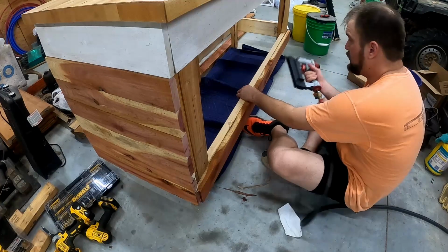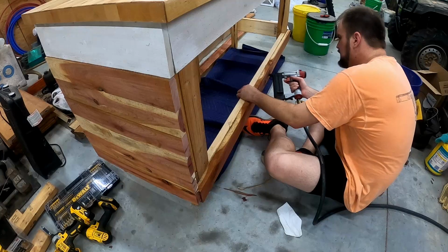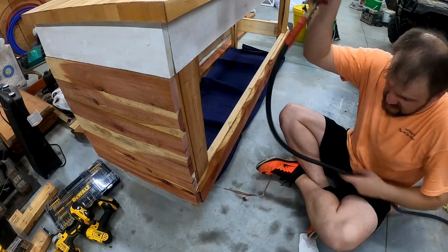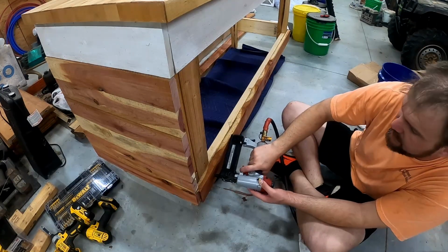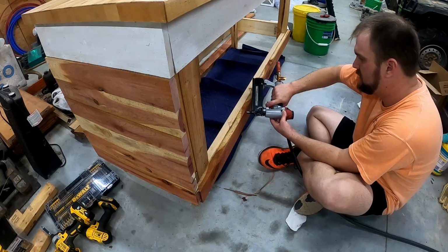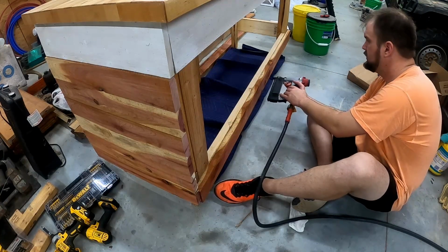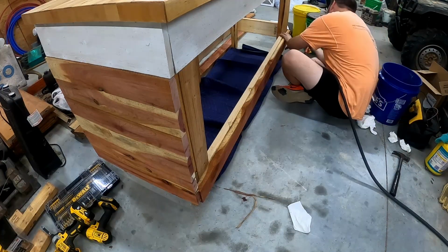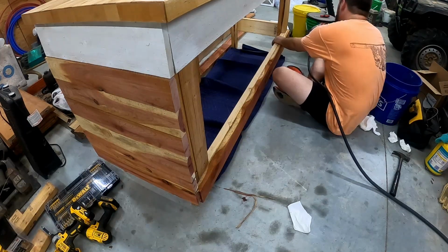All right. When brad nailing, especially with these heavier boards, I like to angle my nails. Those two are just there to get it set in, and then we start setting a bunch of them. Again, angle your nails for better hold and avoid knots. Some people call this a finish nailer. And you can bend the wood just a little bit. I wouldn't make a habit of it.